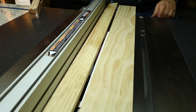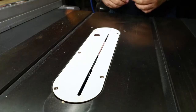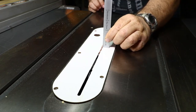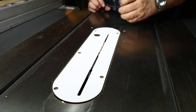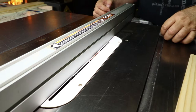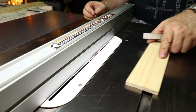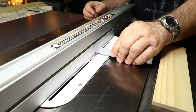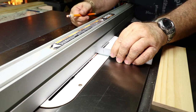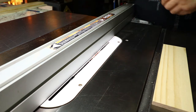These are the two boards on which I'm going to make the tongues — on both the top and the bottom of each board. For all the cuts here I'm setting my blade height at three-sixteenths of an inch, and that height stays the same for all my cuts. The only variation is adjusting my fence back and forth to change the width of cut. I'm setting the fence three-sixteenths of an inch away from the outside of the blade edge to give maximum depth for the tongue, then I'll switch the fence to the other side to trim off any excess.